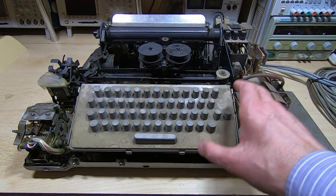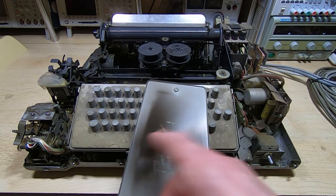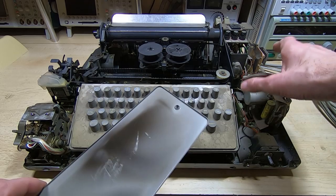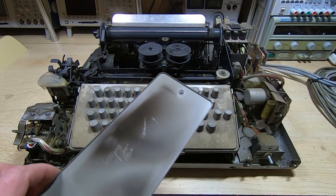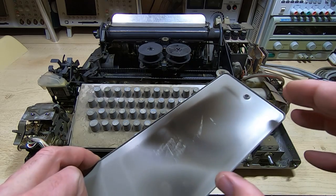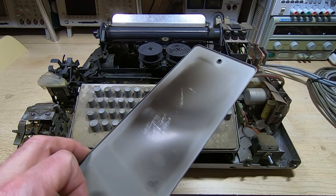Just wanted to show this before I clean it off. This is the right-hand cover plate, and when you turn it over you see all this what appears to be burning on the inside. This is fairly typical for these machines — there's a lot of heat built up on this side: a lot of power resistors, transformers, that sort of thing. It does tend to look like this whenever it's been used for a length of time. It's nothing serious and it will clean off, so if you see something like this it is typical and not necessarily anything to be concerned about.